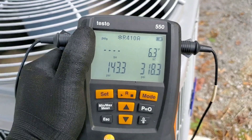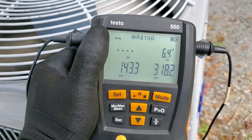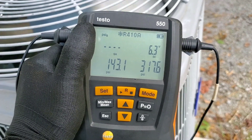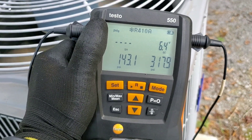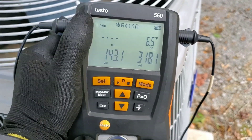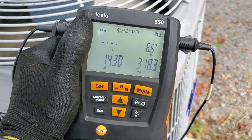These are the numbers we're looking at — when you go to fix one problem, especially on an overcharge, a lot of times you'll stumble across the original problem. That's why it's always good to check superheat and subcooling anytime you put gauges on or adjust refrigerant charges, because this could have saved somebody from wasting their time dumping a bunch of refrigerant in here. So what we're going to do is quote a new TXV and filter dryer, recover all the refrigerant, put virgin refrigerant back in, and go from there. We have a TXV that is stuck wide open — hope you enjoyed the video, thanks for watching, comment below, and we'll see you on the next one.